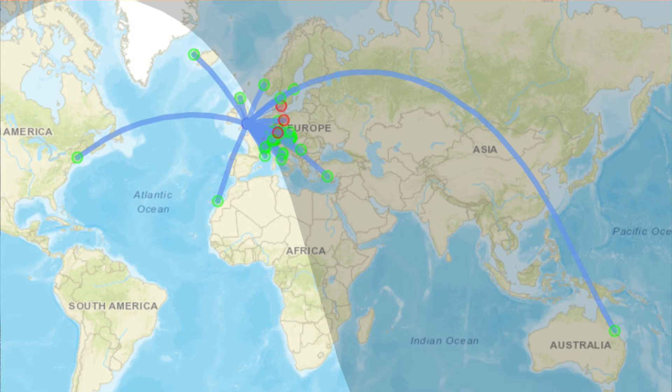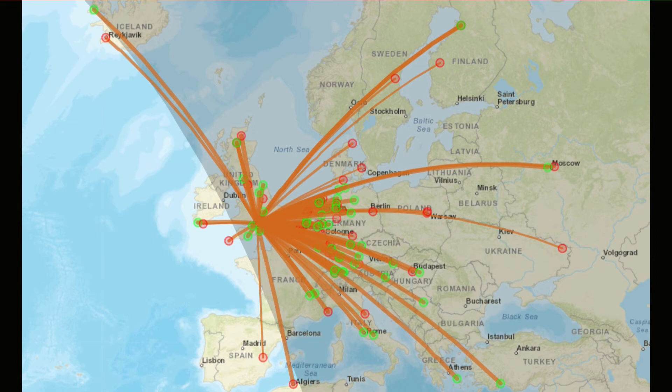Going down to 40 meters - in my view this is where this antenna really shone. I didn't get anything in terms of DX, and as you can see from the WSPR plot I was on the gray line, but due to the way it's mounted and its location I suspect I'm not getting much low angle. Within a 500 to 1500 mile radius though, it's working really quite well - getting quite good NVIS. What's happening is the low angle radiation is being blocked, but the high angle is going straight up and raining back down within that 500 to 1500 mile radius. It's actually working really well as an NVIS antenna.